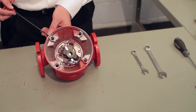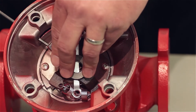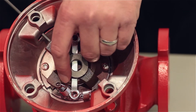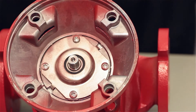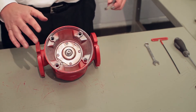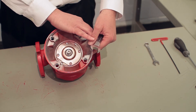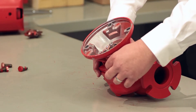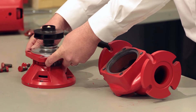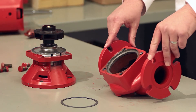Now I'm going to remove the other half of the coupler with my one-eighth inch hex key and set that aside for later. At this point, we're going to remove our bearing assembly from the volute using our five-eighths inch wrench. Once the last bolt has been removed, we can pull the seal bearing assembly free from the volute. Inside, you'll find a gasket that may or may not need to be scraped off, depending on how long it's been inside that volute.